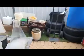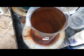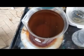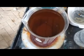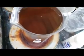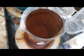Well, diluting the solution has helped. You can see the gold at the bottom. So now I'm going to pour this off. And for those who haven't seen my other videos, I have a large flask here. And I always pour off my gold drop water and gold wash water, etc., into that flask. Because what happens is tiny little bits of gold and bits of fine dust that you can't see eventually travel over, and over time, over a couple of days or whatever, settle in the bottom of the flask. So in case this gold stirs up and little bits of it escape, I'll end up catching it in the flask. Now I'm going to need two hands for this, so I'll go and do that now.